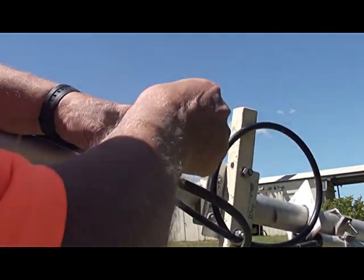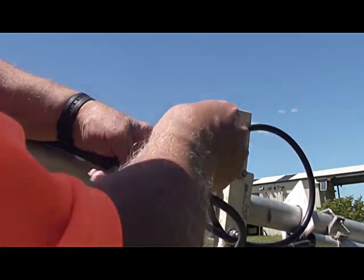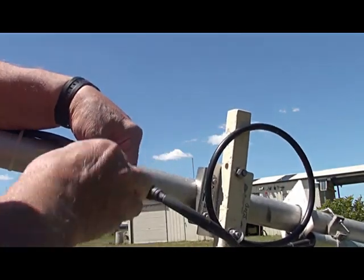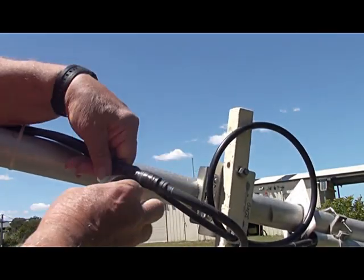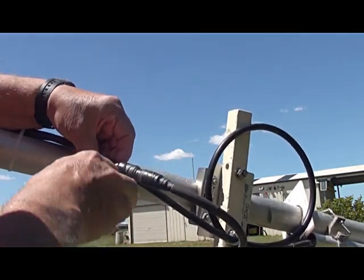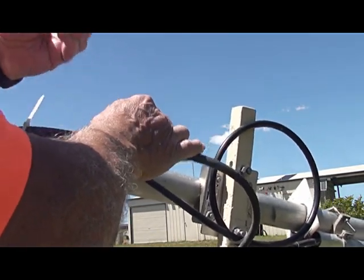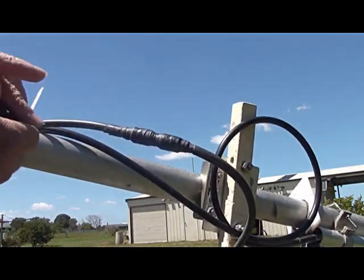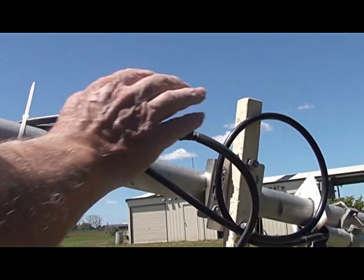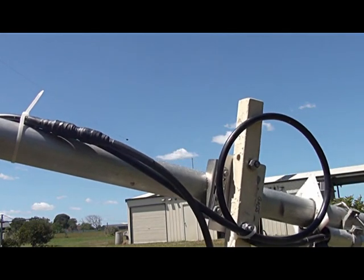I haven't used it for a while, but we're back in the good bit now. We might do another layer here. If you want the antenna to keep working, you need something like this on your connectors. If you don't do that, six months time — and particularly here in Montague, which is very salty — your connection starts to become unreliable.